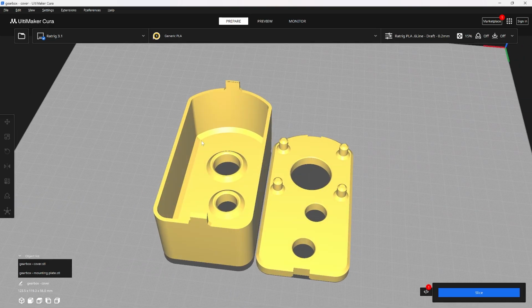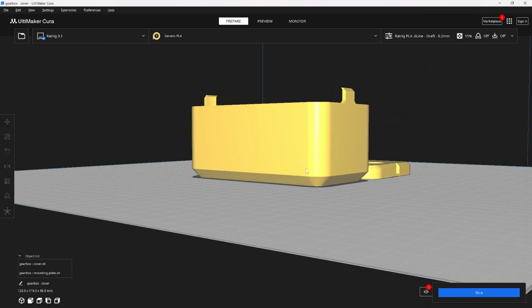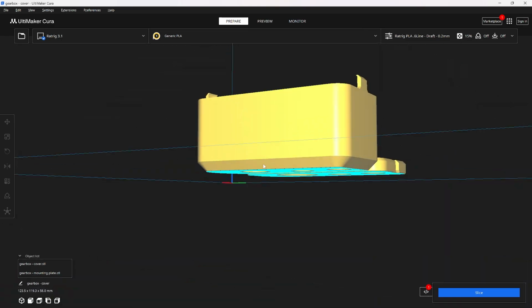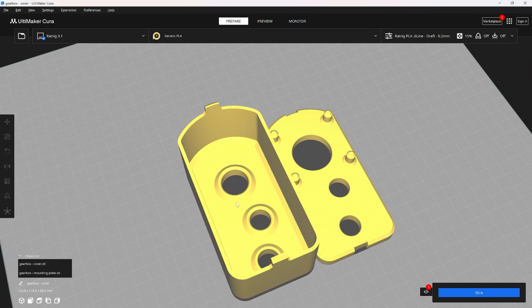And on the inside of the gearbox, I have it recessed a little bit more. It looks a little bit weird, but it's for the best. You see, when printing this big flat surface area, when it starts doing the top skin again, sometimes you'll get an excess bulge line across the side of your piece. Well, now I made this top shelf a little bit lower, so now it's in this chamfered area. So now when you print it, it doesn't make such a weird line across there. You get much cleaner looking prints, uses a little bit less material, but all the same indexing goodness.